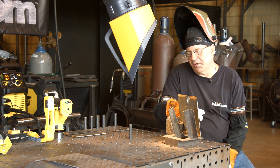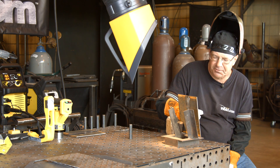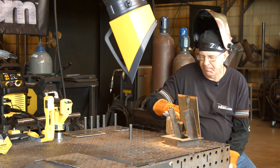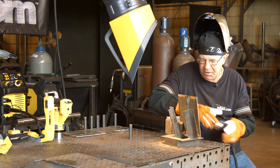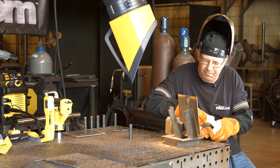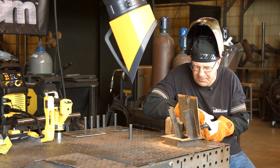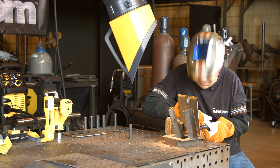I've leaned this up near 90 degrees, as close as I can get it. We've also positioned the camera on the backside so we can get some penetration footage. I've got my trusty fire brick prop so I can maintain the same wire angle — straight in, very slightly downhill. All right, let's give this a run.